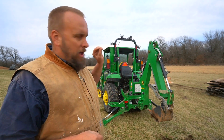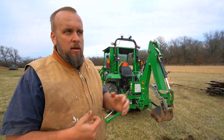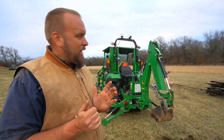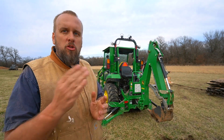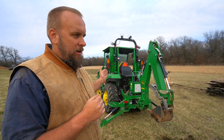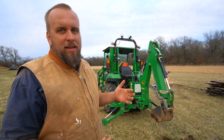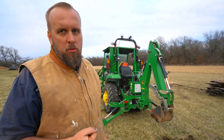What I do know is that I was putting maximum force on this. 100% of everything the backhoe had to lift this an inch off the ground and move it. And I've seen a lot of people damage their backhoes, and that's the last thing I want to do. So you can be the judge with this machine if it's worth it to move it that way. Or are you really not saving that much time but putting a ton of strain on the boom of your backhoe?